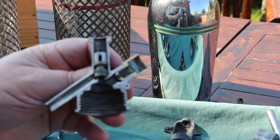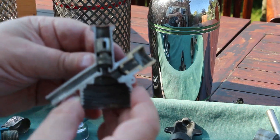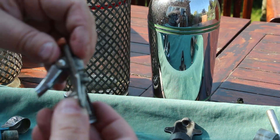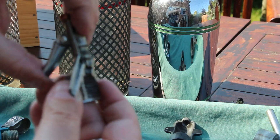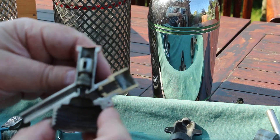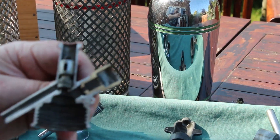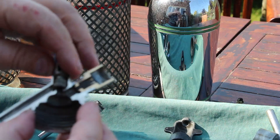Here we have a Type D head, and here is the piston piece moving up and down — that's what is actuated by the lever on the outside. You can see the lever is actually moving it. There would have been the spring on top which pushes it down against the force of the carbon dioxide pressure and water pressure trying to force it up. Quite ingenious.